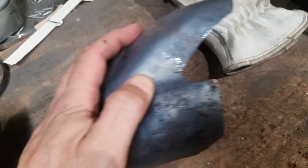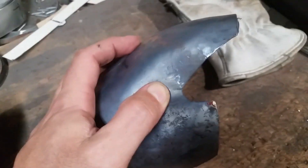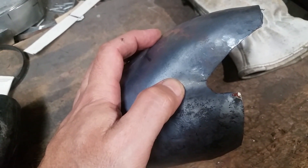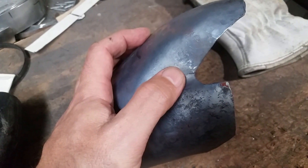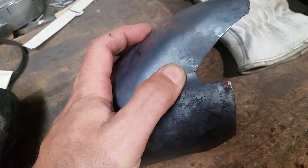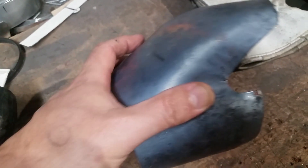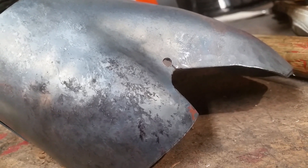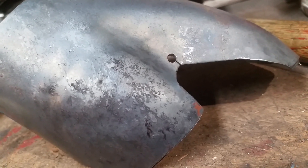What I do is I'll drill out a hole — I'll have to go off camera because you can see I'm holding this camera — I'll show you what that is and then how I cut it to the shape vaguely and work on from there. So the first thing is about an eighth of an inch drill — 3mm or so — just punch a hole through there. Hopefully a little close-up of the crack that formed: now it's a 4mm hole rather than 3mm as I stated. What's a mil between friends, I guess.